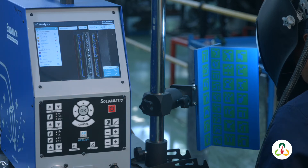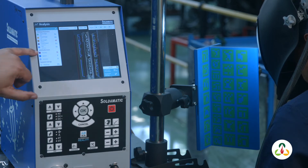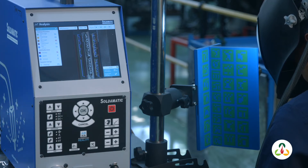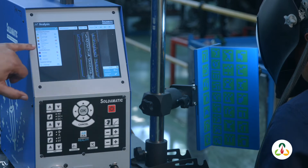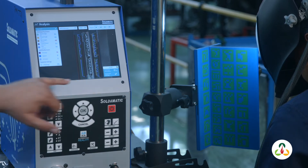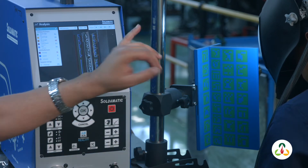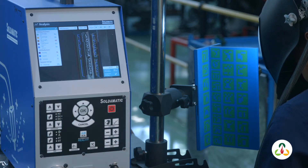For example, his arc length is a bit too long. His porosity in his weld. Spatter. Fortunately for him, he has no inclusions in the weld, but the rest of his parameters are quite fine. That's what gave him a pass mark of 81%. You can see scores in the green there with a green tag, so it means he's done okay for this particular exercise.